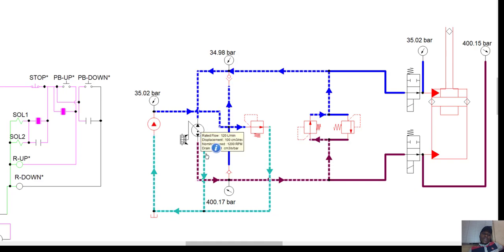The drain line is connected to our tank supply. This is the only situation where our pump is connected to the tank. The drain line relieves all the excess pressure in our pump housing, because the system is not a perfect system — there will be some minor leakage. The leakage fluid is dumped into the tank from our pump through this drain line.